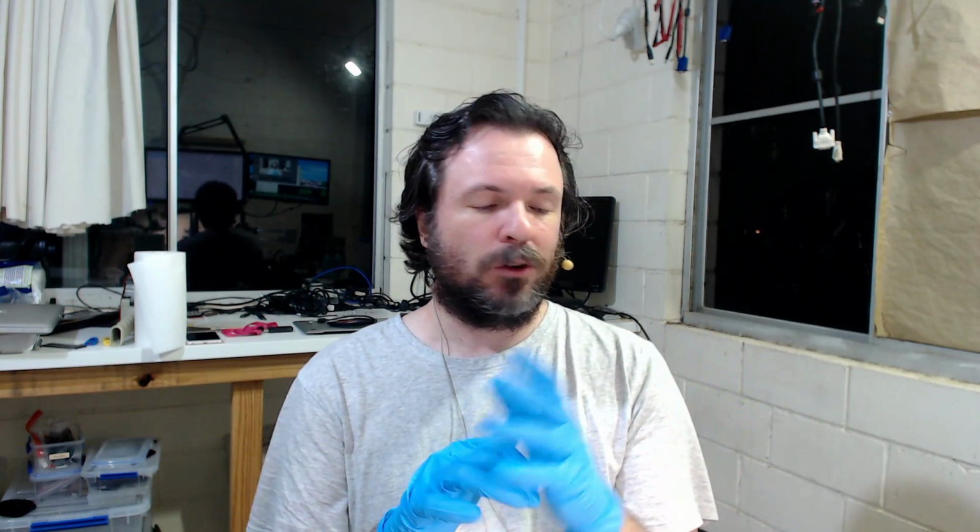So it goes to show, the hint was there in the form of that bent USB connector. There wasn't any visible things on the board in terms of corrosion or cracks or anything, but by looking at the fact that we had a bent USB connector, we were able to then go, yeah, maybe the physical cracking had occurred, and doing the testing to see that it was only one port and the other. Funnily enough, technically, both those ports should have failed, and I believe when this was tested, that was the case. Both ports had failed. It was just through shipping that one of those filter packs had managed to get close enough together and the USB 2 tolerance was enough that it could work through the damaged filter pack.